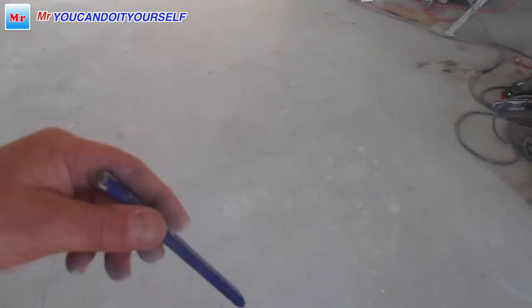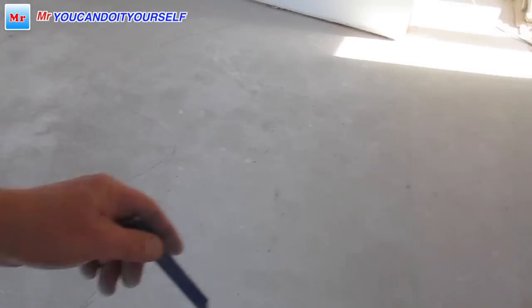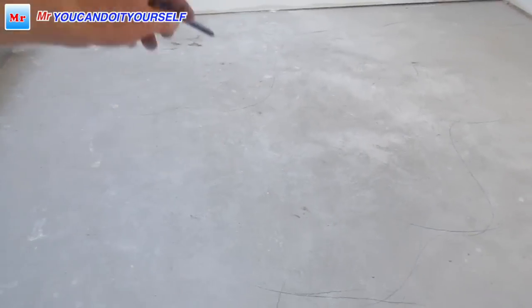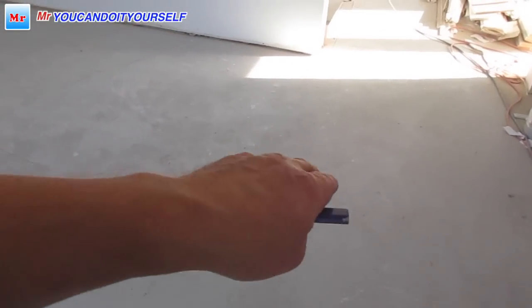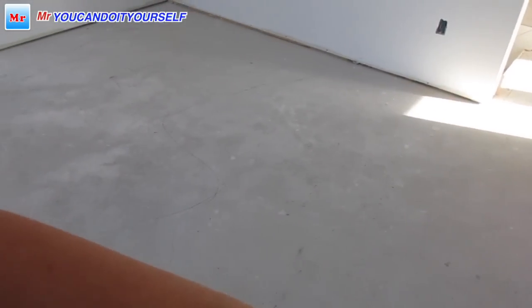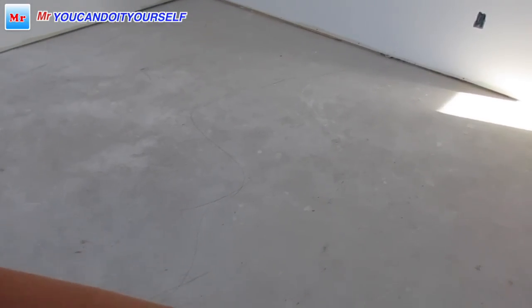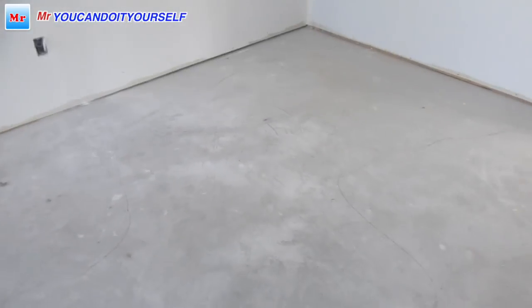So most of the leveling, you have to do opposite your new floor direction. So if you go this way with the installation, most of the leveling needs to start opposite. Okay? Because if it's a little wavy along your floor direction, it's not visible. But when you go opposite the floor direction and it's wavy, you can see all the bad things. It's really tough.